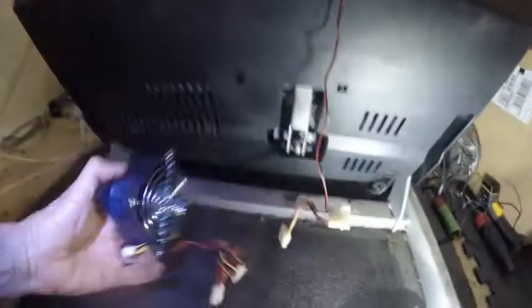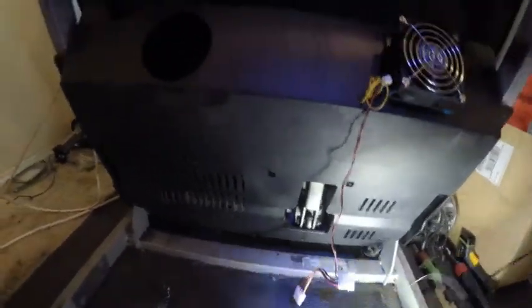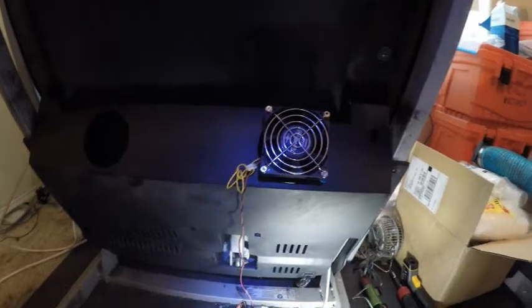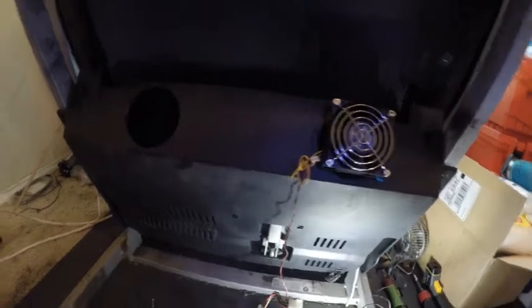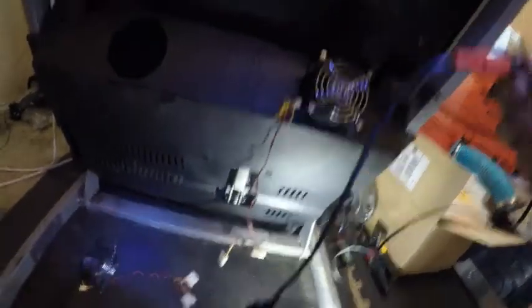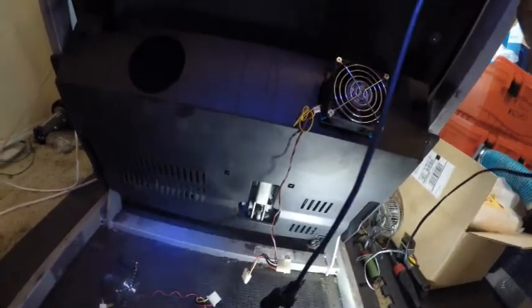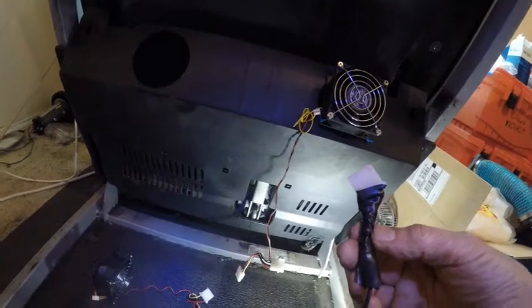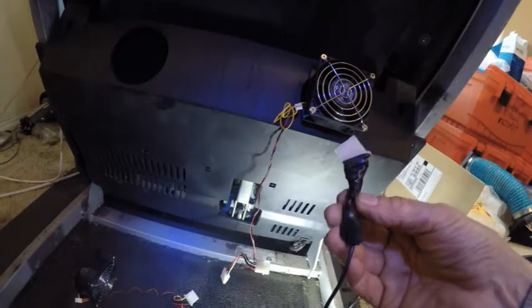These are computer fans. What you have to do is make sure the power supply has enough amperage output to power the fans. You could even put two on one supply, but they might run faster or slower, or one of them might not even start. So I got two separate ones. What I did here is I took a plug off of a damaged security camera that was no good anymore. I took the red, black, and yellow wires — this particular fan uses the yellow one also to power it.